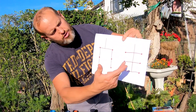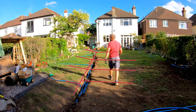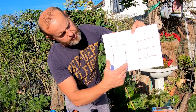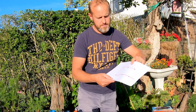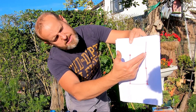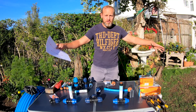The system we're trying to achieve is where you come in with a pipe in the middle and branch off each side connecting your sprinklers — or a U-shape where your initial pipe comes in for the zone, branches off two sides, and you have say three sprinklers on each line. What you don't want to do is create a daisy chain of five or six sprinklers coming in from the top connected in series, because the first sprinkler will get full pressure and the last one will have very little — all the pressure is used up by the sprinklers before it. So you want to branch off the sprinklers.